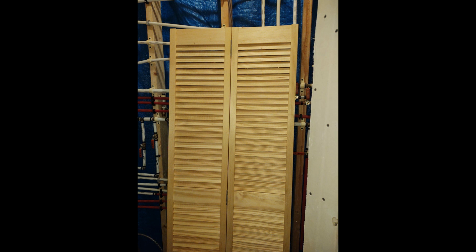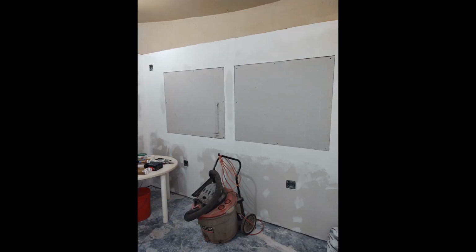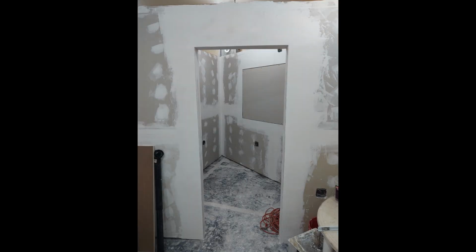And there's going to be the doors to those 2 little areas, one of them there for into what we're going to call the plumbing room. And again, it will hold also a full-size 50 or perhaps larger hot water tank, but it'll all be solar. It'll be attached to a few solar panels on the surface to just simply heat water. The Roswell area is pretty good about number of sun days. But in the event that it is cloudy, you don't have a lot of solar, you don't have a lot of hot water, you can just simply fire up the other unit. You can fire it off of the already preheated water in the tank. So it's not going to be using much energy to heat it from that. Let's say it's at 100 degrees and to heat it to 120 is not going to take much.